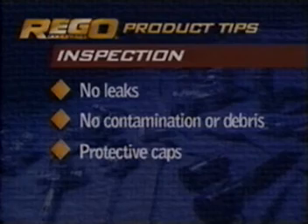There should be a protective cap in place at all times. Damaged or missing caps should be replaced at once. Under normal conditions, the recommended life of a relief valve is 10 years from the original manufacture date. However, this life may be shortened and replacement required earlier depending on the environment.